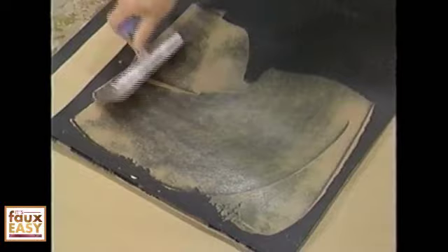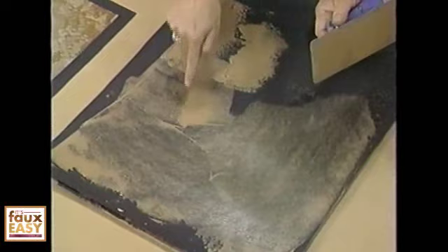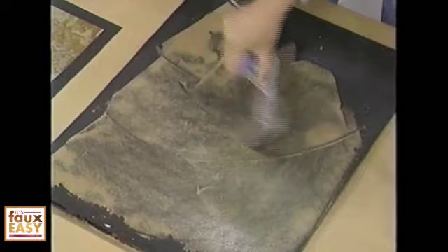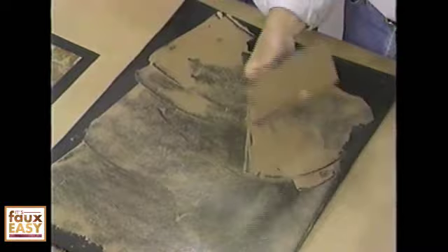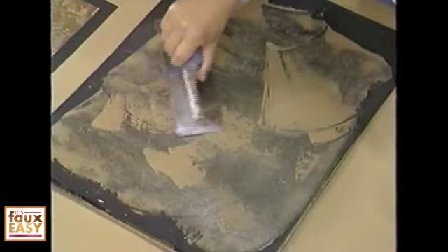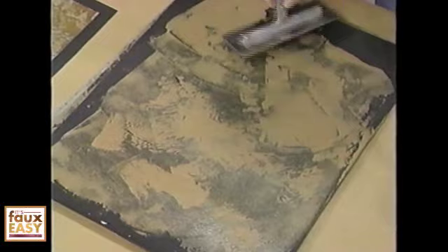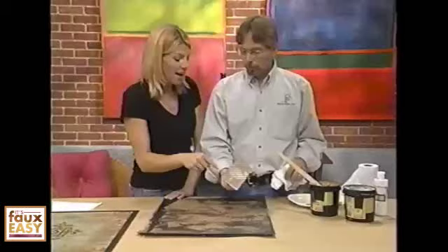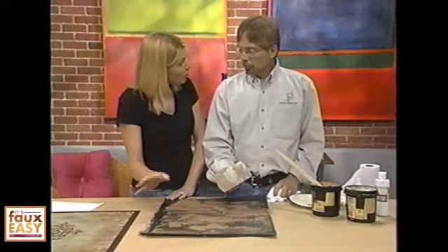Not that I want to change the look at all, but I'm just thinking you could even leave it with these little raised points, right? Yep, and you can just do this step — super easy. For the basic beginner at home, you can absolutely just do that step. So now you can take that and add a little bit more material onto the surface — less on here — and just let it skip across the surface so it catches in some areas and not in others. You can see how it grabs and catches, and now I see my low scraped area and my higher dimensional area. I want you to briefly go over proper use of a trowel, because people aren't sure how to use a tool properly and won't be able to create the same look unless they get that under control.